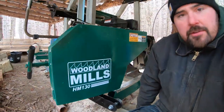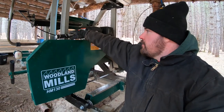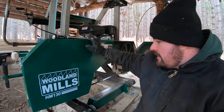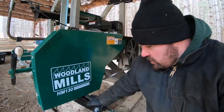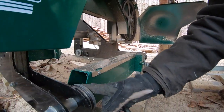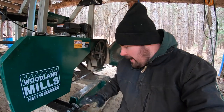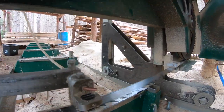If you're looking for an easy way to tell whether your sawmill bed is flat and level, just rock your machine. Obviously with the door shut, grab onto the handle and give it a few shakes. These wheels here - all four of them - have to be in contact with those rails on your bed at all times. If you rock the machine and you can feel a wheel coming up and down a little bit, that's going to tell you it is definitely not flat or level and you have to make some adjustments. Give that a try.